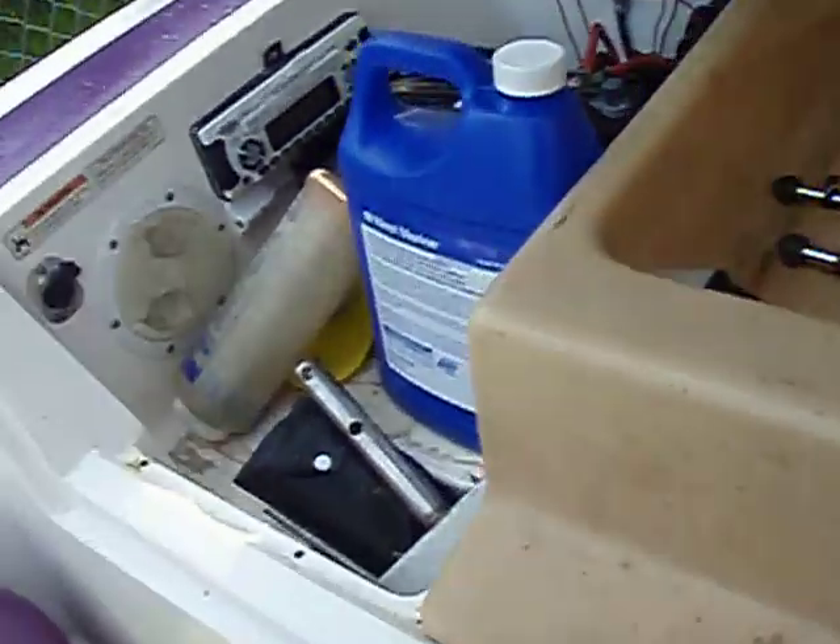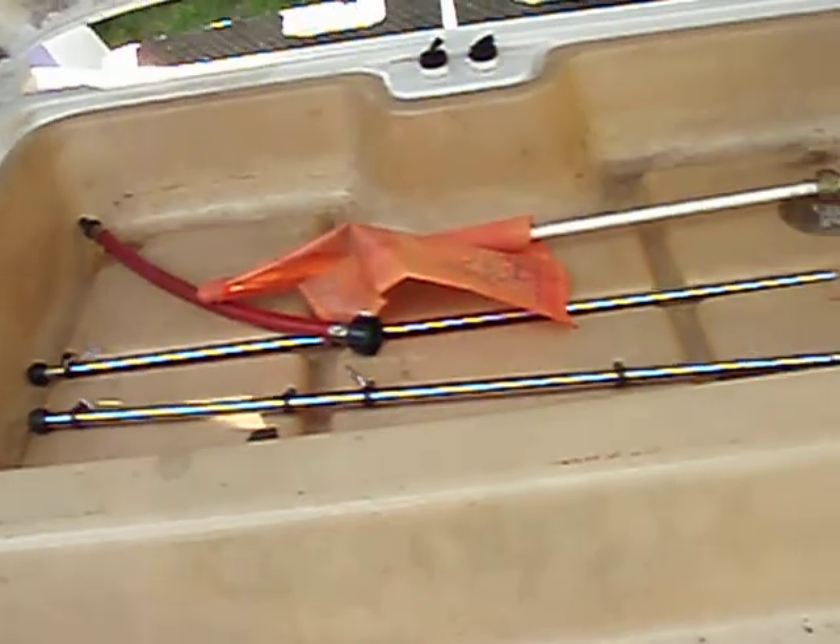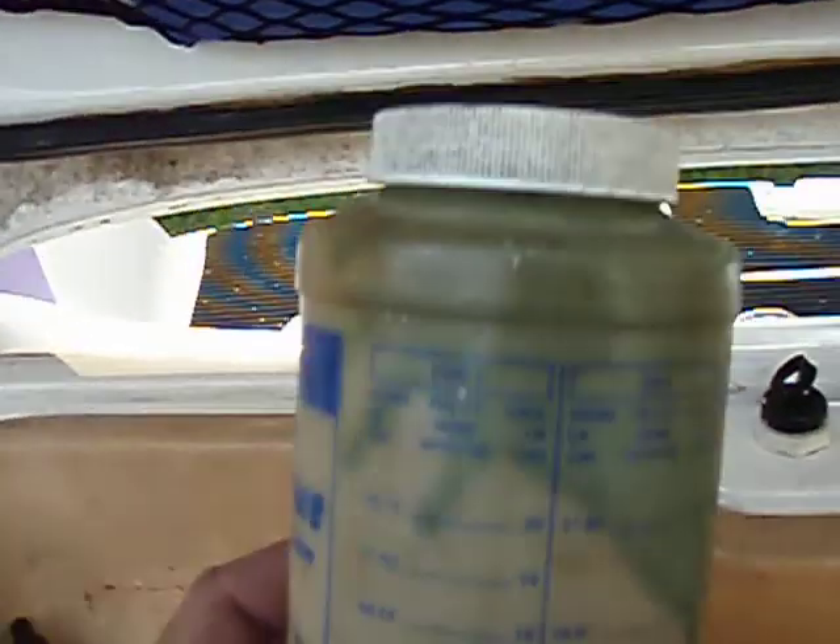This boat has been converted to pre-mix, which means you have to mix the two-cycle oil and the gas together. It uses a 50 to 1 mixture ratio. I have a little bottle in here that I use to mix it — it's very simple. I pull up to the gas pump, fill the tank with gas, and take note of how many gallons I've put in. If I've put eight gallons of gas, I find the side for 50 to 1 on the bottle, go down to eight gallons on the scale, fill the bottle up to that line with oil, then pour it into the gas tank using the little funnel. If you put 18 gallons, you'd fill to 10, pour it in, then fill to 8 and pour it in for a total of 18. It makes mixing very simple, so I'm going to leave that in there for you.